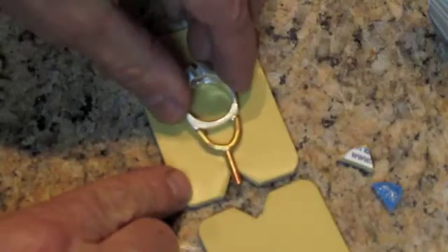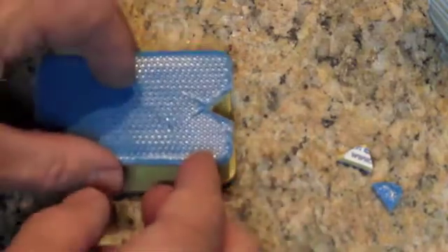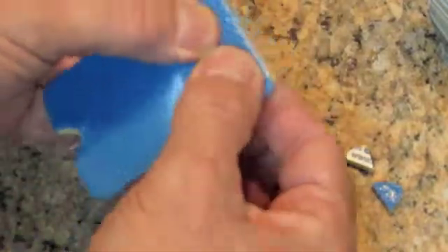There's the ring model. It has a Y-shaped sprue on it. I sprue to the thickest part of the ring shank to try and encourage progressive solidification of the wax, and also the metal when it flows into the ring.